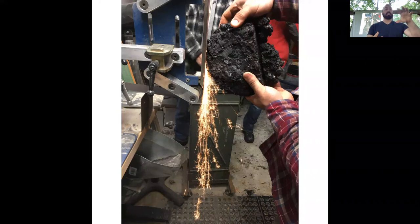And then, it's a big furnace, it drops maybe around here, it starts to turn into iron. And as it continues dropping, it just sucks in carbon and it becomes steel. Yeah, it's about 5 feet tall, maybe a little bit taller. And it's like a layer cake. One layer of ore, one layer of charcoal, and it just continues dropping and dropping as it burns.